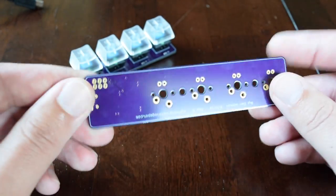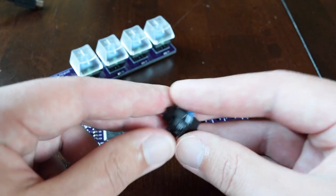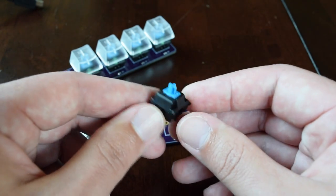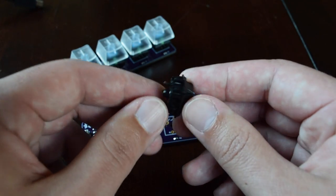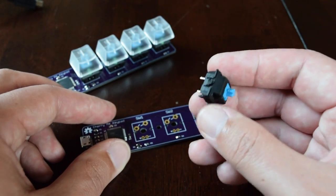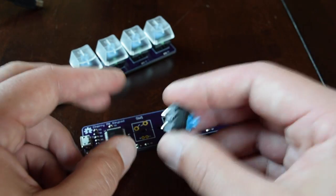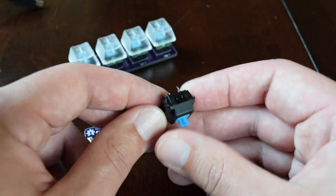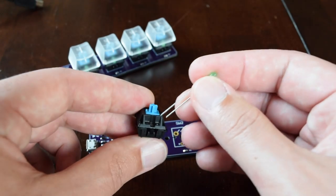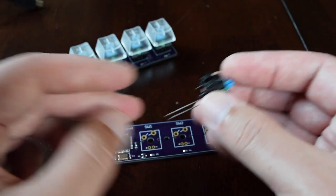If you assemble all the surface mount parts, this is what you'll have. After that, you're going to need to solder on your Cherry MX keys — this is what they look like. Even though keyboards that use Cherry MX keys are pretty expensive, the keys themselves are not all that pricey. As you'll see from the links on my blog post, you can get them for under a dollar for a Cherry MX key, so they aren't super crazy expensive. As far as using them on boards, it's very simple — it's literally just a switch in a circuit. After you solder on your Cherry MX keys, the 3mm LED just goes into this little recess in the key, and that solders right into the board.